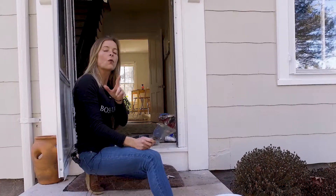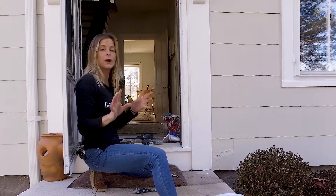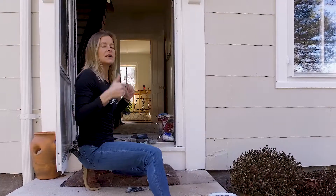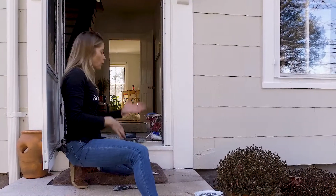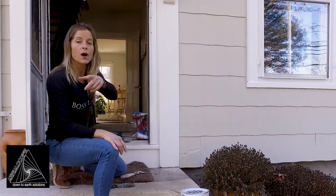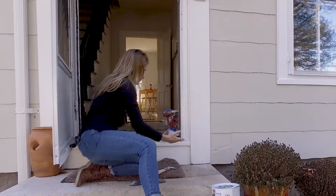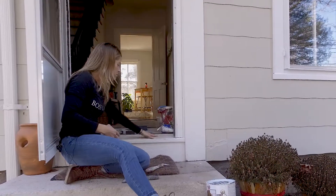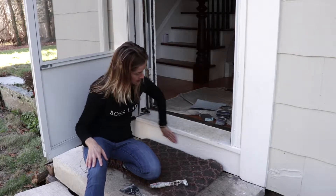Following removing the loose paint, I bring in my five-inch orbital sanders. I have the best tool — five-inch orbital sanders — which are great for interior projects. I also have my DeWalt, which is really heavy-duty, can take a beating, and isn't as expensive. My DeWalt five-inch orbital sanders take different grits of paper. I used 120 grit to take care of this entry, bringing down all the high ridges of the old paint still existing to give me a nice smooth surface.